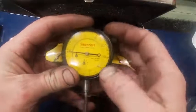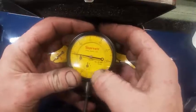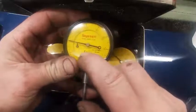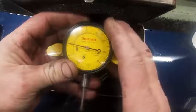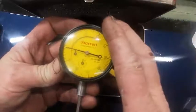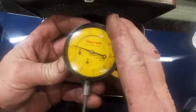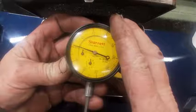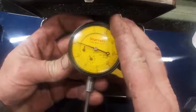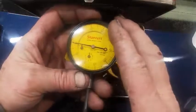This one has a .01 millimeter increment scale. On this one, we have a second dial that's going to go all the way around. Each mark that it moves — from there to there — is .01 millimeters. If I push this really slow, you'll watch this dial moves at the same time too, and so does that one.